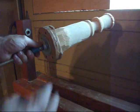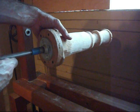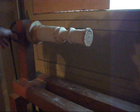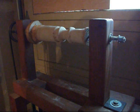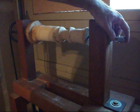If I'm going to turn a piece of work, here I have one mounted to the back of the wood plate I showed earlier — it's something my son is working on. I drop the bolt into the spindle pipe, put the nuts on the back, and tighten it down so it'll spin. Then I have a tool rest that I bring up; it sits on the bed with a bolt that goes through the two rails and clamps it in place. The tailstock spindle is another five-eighths inch bolt through a couple of furniture bearings with a spring for tension, exactly like the other end but without a pulley.